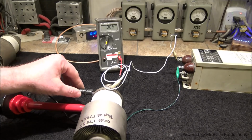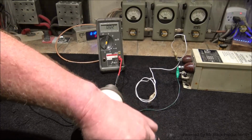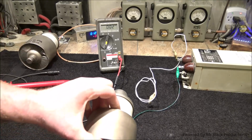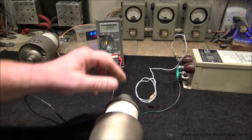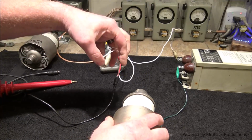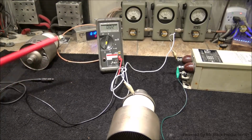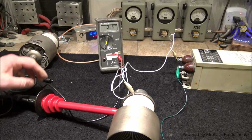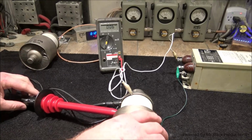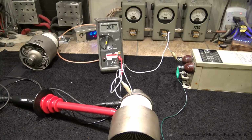Now we don't know if that's going to present itself or not on this tube here, but we're going to give ourselves a try. I know that when we hit it with this big power supply, which we way overbuilt when we built it, we have a short that's presenting itself internally on the tube. But the filament draw is enough to make me KO this tube into the scrap heap. Okay, let's see what happens here.